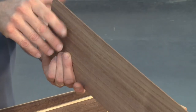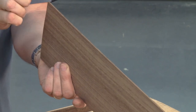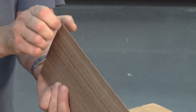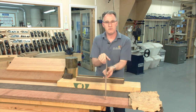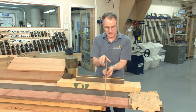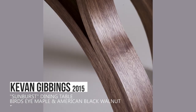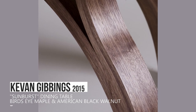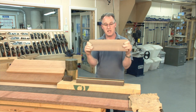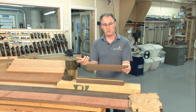This veneer is quite thick — this is an eighth of an inch, about three millimeters thick. This is a machine-cut veneer, but thickness-wise this matches what we would have had from a hand-sawn veneer from 100, 200, or 300 years ago. This is what we call a constructional veneer, so we use these for putting together to make bent chair legs or constructions that need to be strong but curved, if we're not going down the lines of steam bending or another bending method.